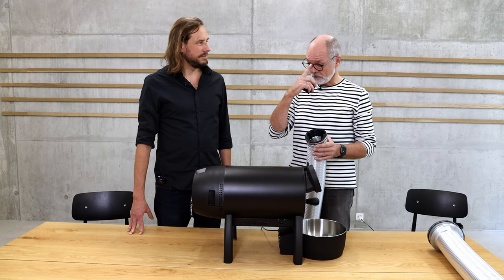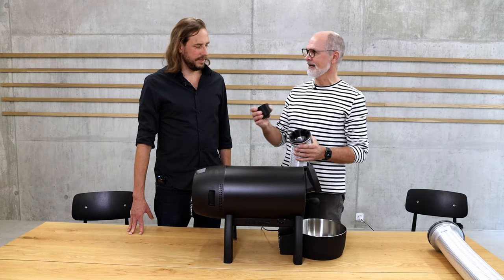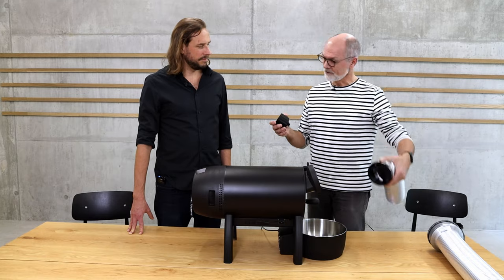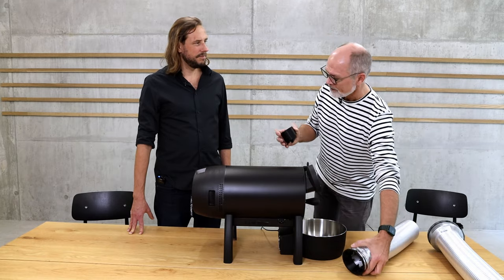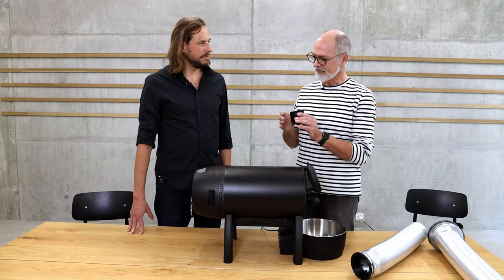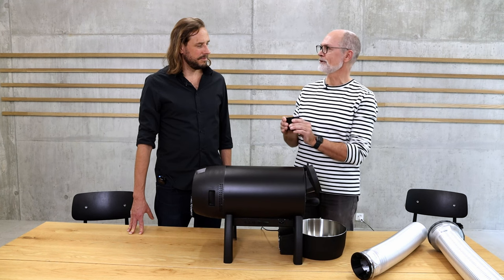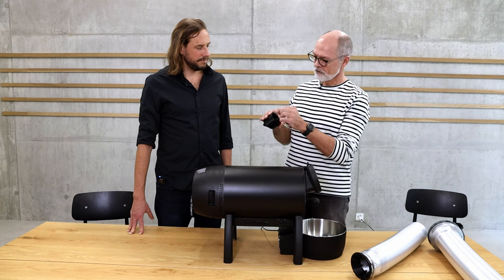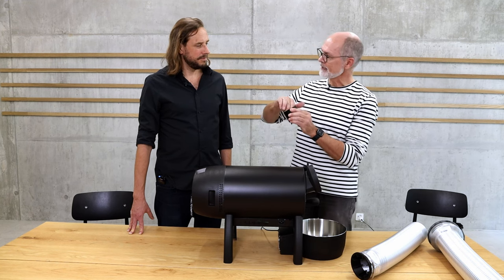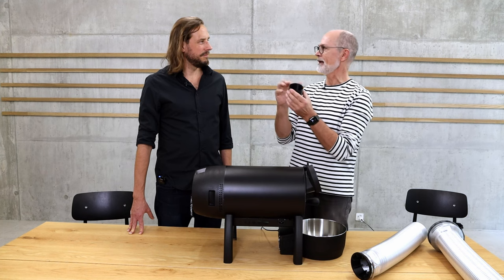Which can actually withstand those temperatures, but not that high temperature. And now it gets a little bit complicated. The other consideration comes into play. You will need to tell your 3D printing company that you need an infill of much more than they usually do. You have a wall thickness, and in between the outer surface and the inner surface, you have hard 100% fill. Otherwise, you would have holes in it.